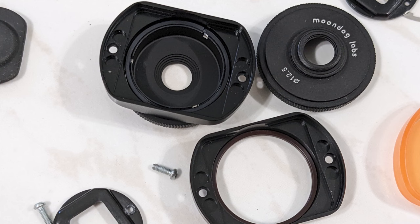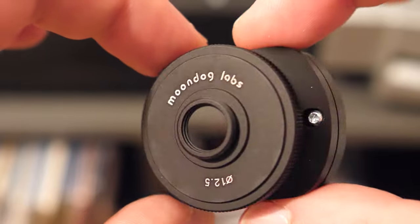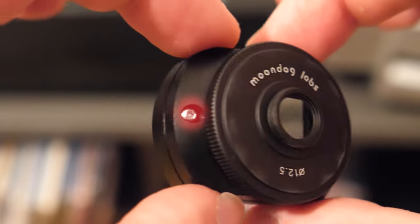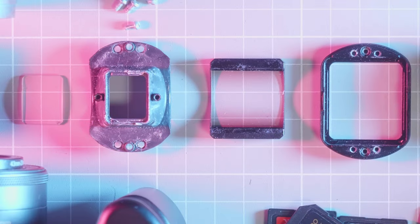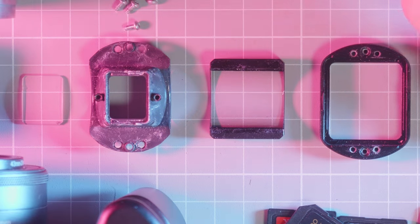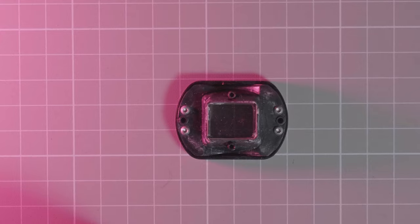So this is what the lens looks like after you start to tear it down. Regrettably, I don't have any great photos or video of the actual teardown process, but I'll do my best to explain what each individual part does and its significance for this modification. The first screws that you'll need to remove are these, which separate the rear portion with the threads or bayonet mount from the front lens assembly. That front assembly has what we're most interested in because it houses both elements that make up the anamorphic lens. This plate right here seemed to be an iris and/or something to secure the rear element to the main assembly. The rear element wasn't particularly loose when I first opened this up — it's held in with either some light glue or just friction — but regardless, for my modification process this does need to be removed.